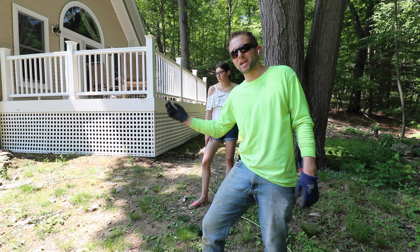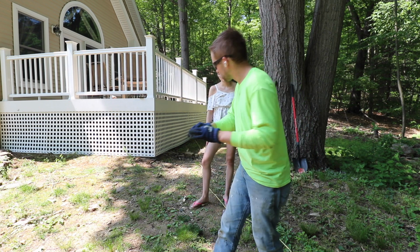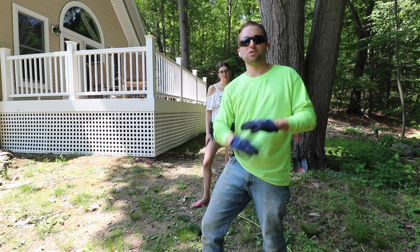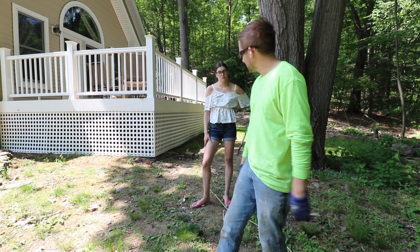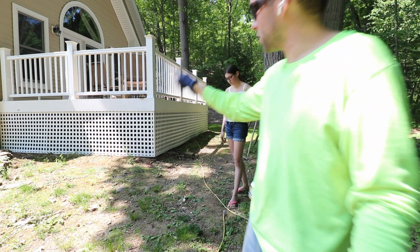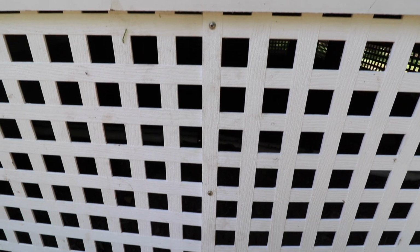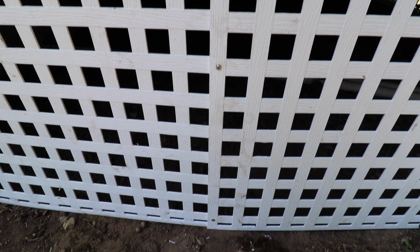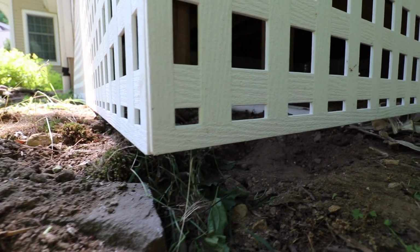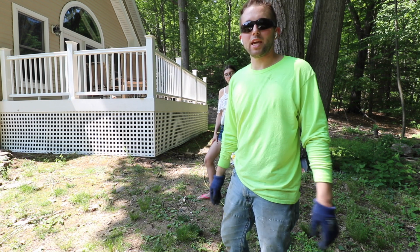All I need to do is go through that little access hatch that I made and just screw on a couple 1x1 strips along the bottom edges of the panels, and that'll straighten them out. But I don't know. I think the results speak for themselves. I will say, though, that I'm really happy about overlapping the panels. I think that came out much cleaner than trying to use the finish edges, which I'll do an overlay right now just to show you kind of what it looks like. But I think that looks really clean, and overall, I'm really happy with the results.